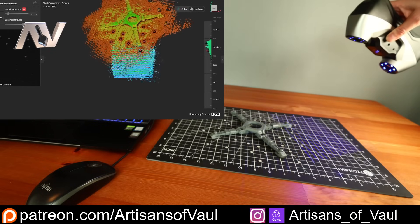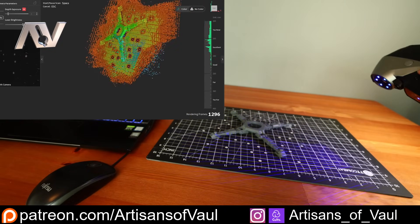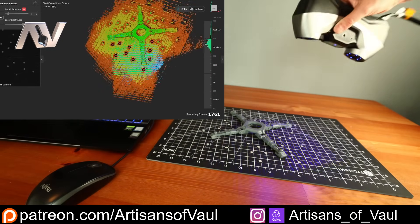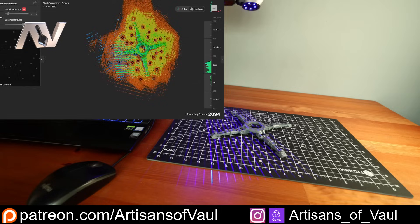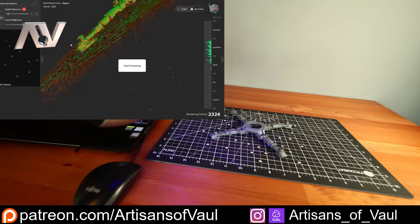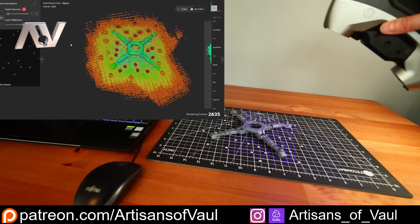While the parallel scan is running, let me cover how the Metro Y compares to the Metro X. In terms of detail, there's not actually much difference — they both have the same sort of precision and accuracy. The main difference is the number of laser lines: the Metro X only had 14, whereas the Metro Y has 30 and the Pro has 34. That makes no difference to the amount of detail in your scans; all it means is the Metro Y gets those results faster and takes less time to scan. I think it's also smaller and a bit less heavy. If you've got neither and are choosing, the Metro Y is definitely more bang for your buck, though the Metro X is still available as a cheaper option.